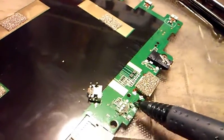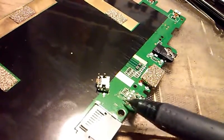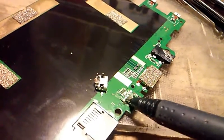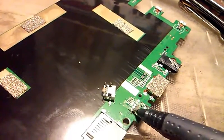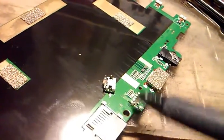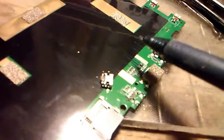It's not always obvious which one corresponds to which trace that's missing. In the case when you don't have these test pads, what you have to do is basically scrape off whatever's left of the trace that came off, and either bridge directly to that little piece that's left, or use your multimeter in continuity mode to see where that little piece of trace connects to. For example, put one lead on that trace and use the other lead to find continuity on that component somewhere on the board, and make sure that's a direct connection, then bridge all the way to that other component.